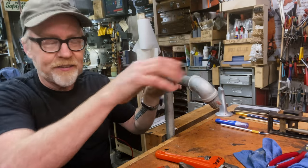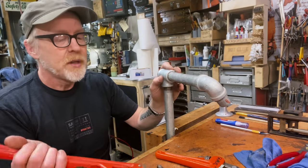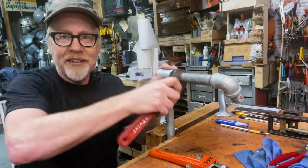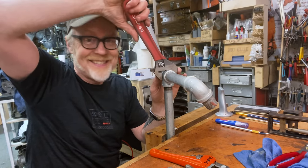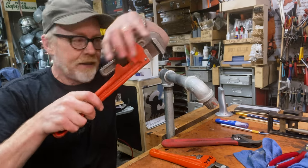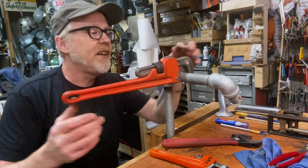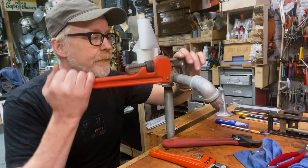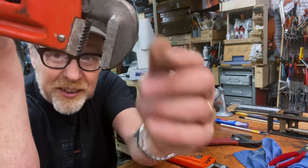So I've got a pipe here that I've mounted into the vise. There's a T and this length here is really tight in this T — this actually used to be my clothing rack in an old apartment I had. So the way a pipe wrench works: if you went and did this with a crescent wrench, and this is for the fully uninitiated into wrench land, you don't have anything to grab onto with a crescent wrench. I mean, you can grab the outside of the T, and I have definitely done this if I had to, but it's far from optimal. With a pipe wrench, what you do is adjust this nut — not until it's at the bottom and not until it's at the outer front. You want it to be about halfway down. This is a pipe wrench at its optimal distance.